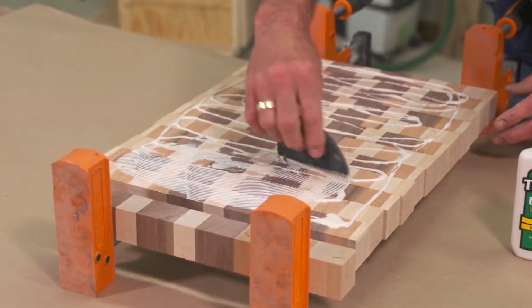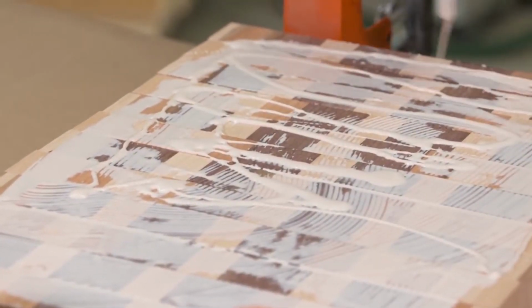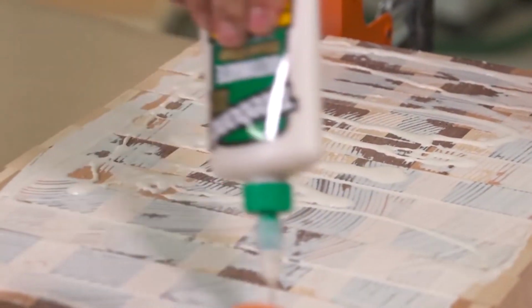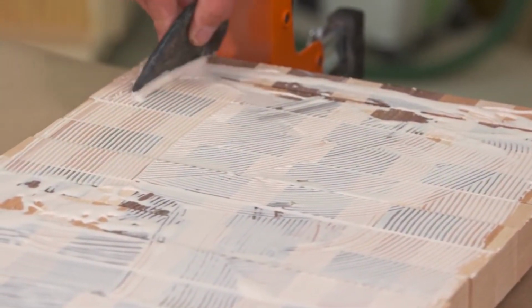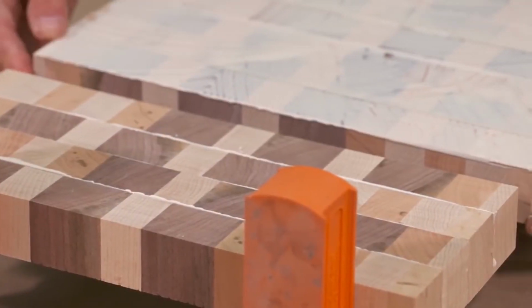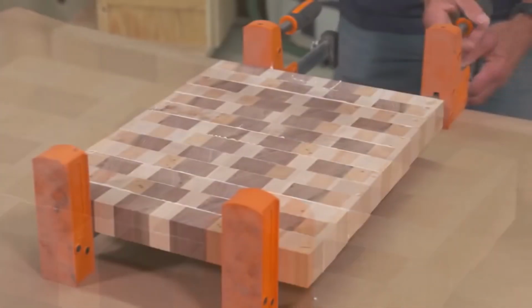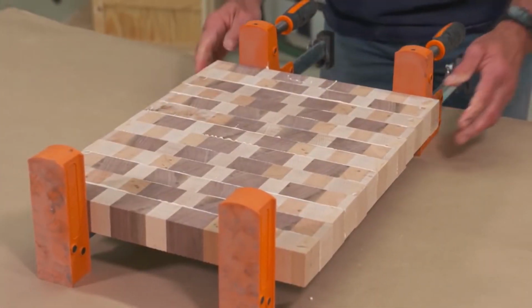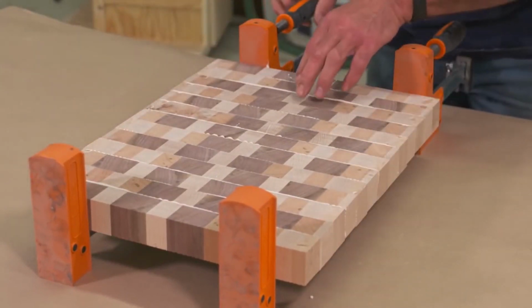So even if you're doing a piece of furniture, an Adirondack chair, that's not gonna be damp all the time, but it's an outdoor project, and you wanna have a little bit more working time to manipulate the parts before the glue starts to set, then again, 3 is gonna be a little bit better choice for you there. It's FDA approved, so that makes it a good choice for food proximity, like cutting boards or stuff in your kitchen.